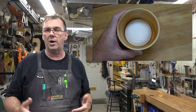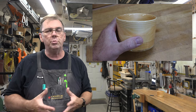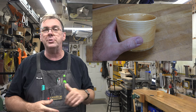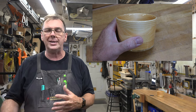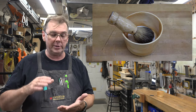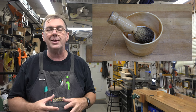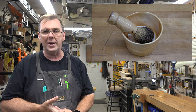There are a lot of techniques in today's show you could pull and use for other things. The main one being tilting that blade on the scroll saw and making the sections to glue together — that was the main intention of this video. The original plan was to use belt and drum sanders to complete the shaping of the inside and outside. It just didn't turn out that way, and sometimes that happens in the shop. Also, that resin does a great job of sealing up wood — if you're planning a project that will see a lot of moisture or water, resin seals it incredibly well and apparently repairs cracks too.